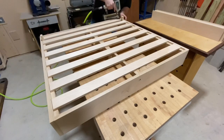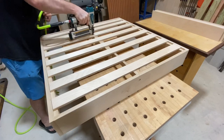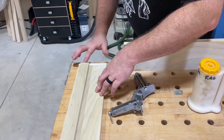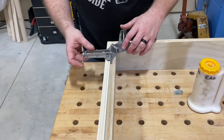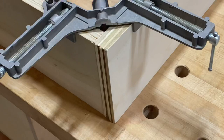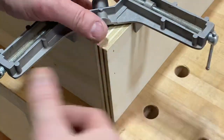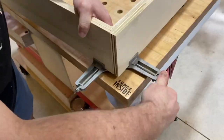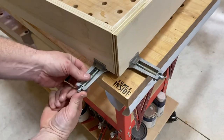I decide that the left and right is all I'm going to use, but I then come back and make the decision to go ahead and brad nail the middle slats down as well. Moving on to make the other three frames, I decided to wisen up a little bit and use a corner clamp to make sure this 90 degree is exactly where it needs to be. These clamps are from Pony Jorgensen and they're linked down below in the description — these clamps are great, they really take all the guesswork out of making a perfect 90. I use one, brad nail it in place, then move it to the bottom and everything is flush perfect.